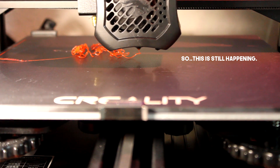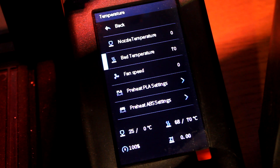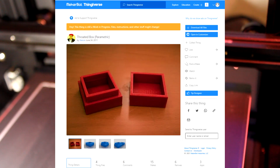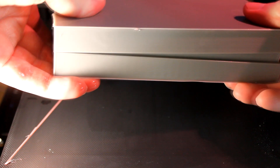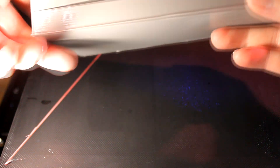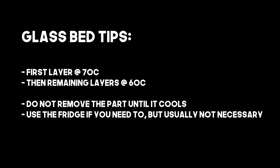When you're done, crank the bed up to 70 degrees C and prime it — by that I just mean print anything big and flat. This will pull any of the remaining coating off the bed. If you're stuck for what to print, I'll recommend something like the parametric box linked below. Once you've done this you're now ready to enjoy your new bed. Please be sure to read up on how to use a glass bed, but the short version is to print at around 60 degrees C and wait for the bed to fully cool to around 25 degrees C or less before trying to remove the part.